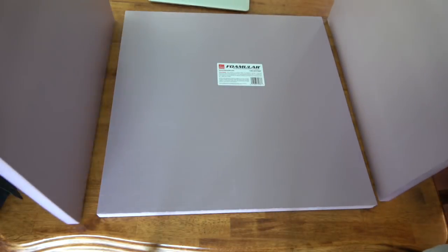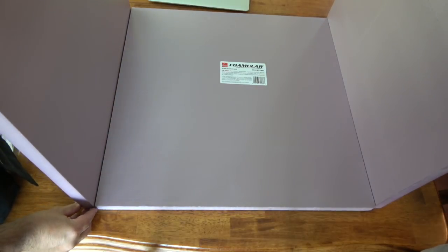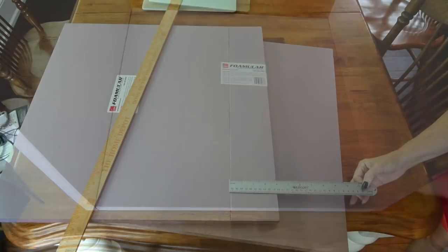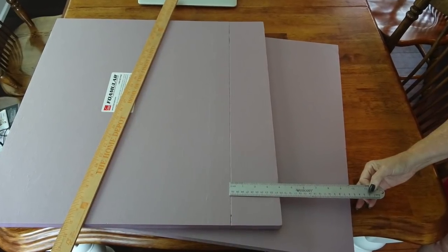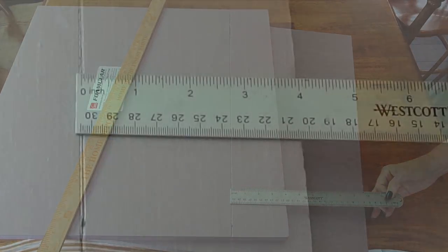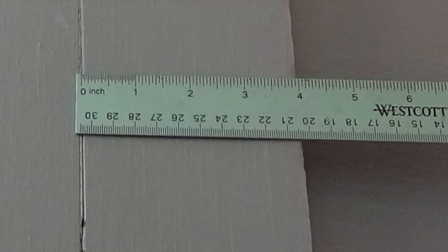We're going to build our shelves out of Foamular XPS project panels. They're 1 inch thick, and one will be the back. In the end, I only used 2, so you only need to get 2 for this project. I just wanted to be sure I had enough material. The side panels will run the length of the unit and will be 4 inches thick. And I ended up slimming those to 3.5 inches, so you may as well start there.